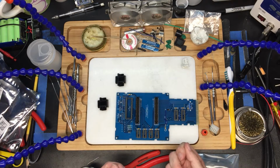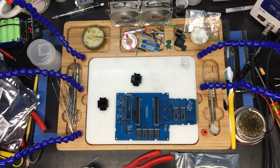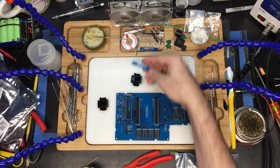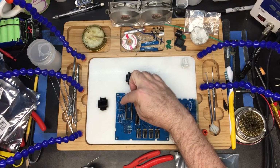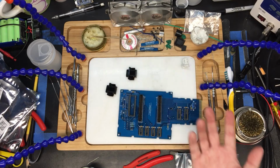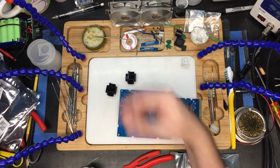First of all, most of you are going to be getting a joystick extension cable that has a male connector on it and then a female that is actually the end of the joystick. You're going to be cutting off one end anyway to solder to these control pads. So you might as well use the other one if you don't want to buy one of these. Solder it to the pads and then trail the male version out of the port. That's one way to save 15 bucks or so a piece on these guys.